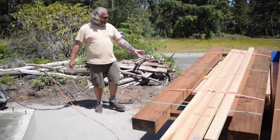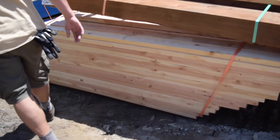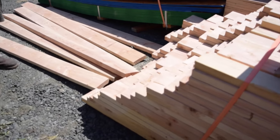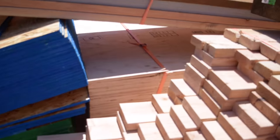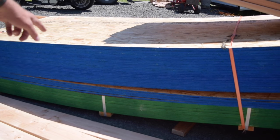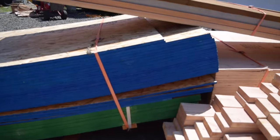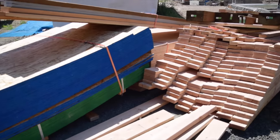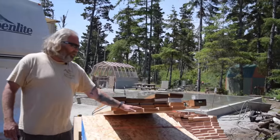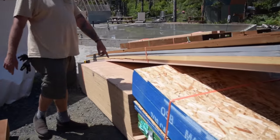There's a big stack of two by sixes right here — it's all the framing for the walls. There's 125 of those, I think. And then we got some two by fours for the interior framing walls. We got all our sheeting for the walls — there's four by eights and these green ones are four by nines. They're going to be on the gable end, so they go up a little above the wall line so we don't just tie into the top plate and have a weak gable. These are the top plates, these are the bottoms, and the framing goes in between the two, some trim. And then our roofing sheeting is right here.